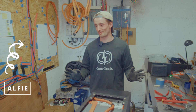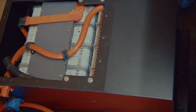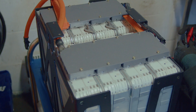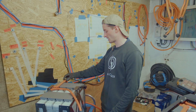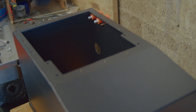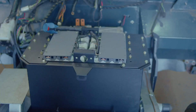So the last week we've been building up these battery boxes for the Series 1. This is one that's pretty much ready to go — all it needs is the lid on, sealing down, and then it's good to go in the car. This one here we've been working on today, all wired up. I've made up all the high voltage cables and the bus bars, all of the looms for the BMS in the car are all ready to go and about to go in the box. The lid's there, it's going to get sealed up and go straight into the Series 1.